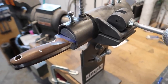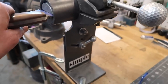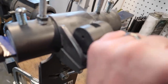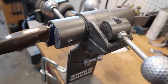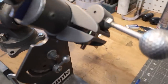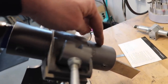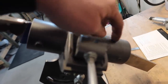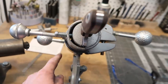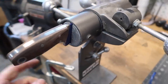For the hand sanding I'm going to be using my knife maker's vice — one I made, and I did a video about this. It's rock solid and beefy. I've got this little cam: when I drilled the pinhole I off-centered it, so I can loosen it off, spin it around, and tighten it back down. It also has a height adjustment. One thing I've noticed is if the blade doesn't go through very far, I put a piece of material in the same thickness as the blade, and that really helps the whole thing clamp — essentially just two pieces of wood with that blade in the middle locking it down. It's a good little unit and well worth the time to build.